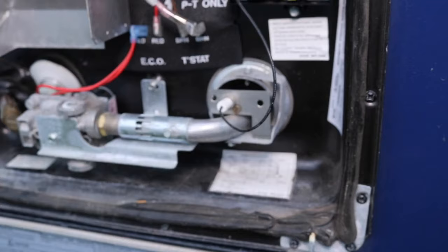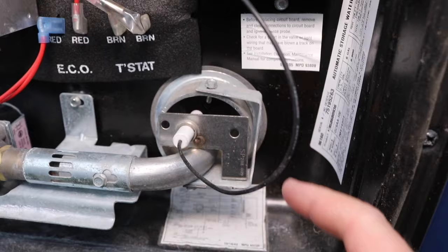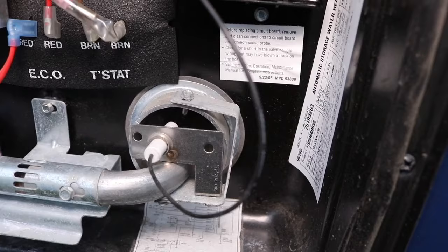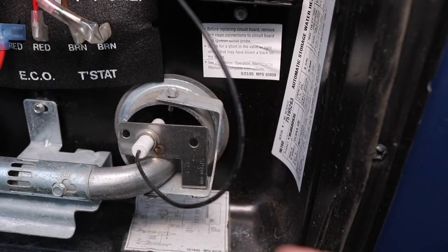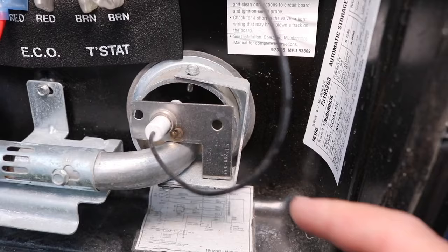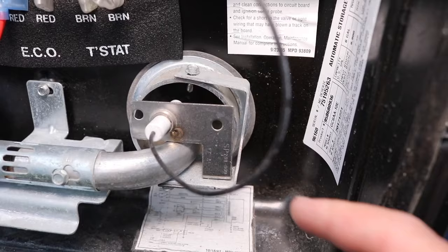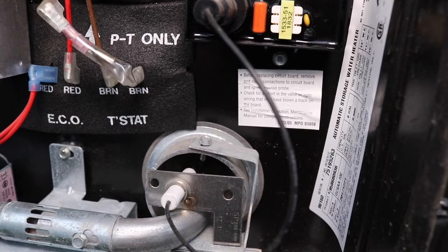You can see the two rods and one sparks on the other one. If there's no spark then you're not going to have a light. On our model, this is also our flame sensor. So another thing to check would be your flame sensor — it's doing the same thing, so take it off and sand it. If either rod is dusty or has soot on it, that's not going to work, and the flame sensor is not going to sense the flame and therefore it's going to turn right off. The way you can tell if it's a flame sensor issue is if it kicks on, fires, and then turns off maybe after 15 or so seconds — sanding that can help make it work.